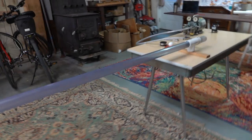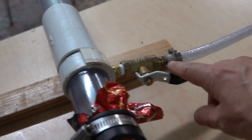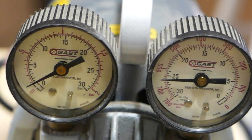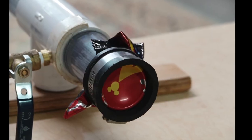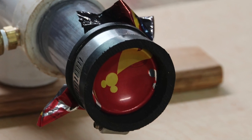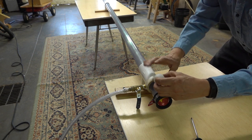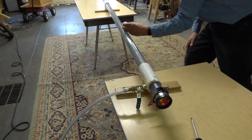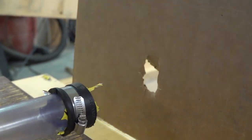The operation of the cannon is fairly simple, but let's take a closer look. The ping pong ball is placed inside the barrel and both ends of the barrel are sealed. The tube runs over to the vacuum pump which is able to evacuate most of the air out of the barrel, but not all of it. The pump has a gauge that indicates the reduction in pressure inside the tube. Meanwhile, the atmosphere is applying 14.7 pounds per square inch on the outside to try and get into that empty space. So when I puncture that back seal, the atmosphere rushes in, and since there is very little air in there, this ball is going to accelerate very, very quickly. The ball only has a mass of a few grams, so by the time it reaches the end of that barrel, it can reach speeds up to about 600 miles an hour. Even with so little mass, at that speed it can pack quite a punch.